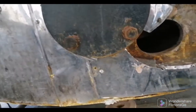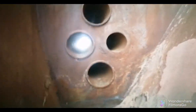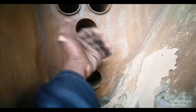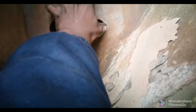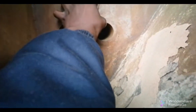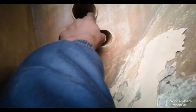When it falls, it comes somewhere here — we push it, then we pull it from here. For some tubes, we have to hammer it in from inside, because if we try to knock it out from the other side, the residue from the scales — which come from our water treatment — will be holding it tight. It will be so tight that we cannot pull it out. But it's much easier if we try to heat it from inside. So now I'm going to show you the process of cutting out the pipe.